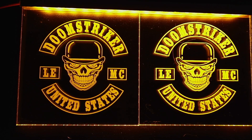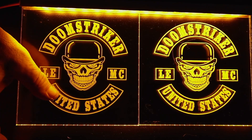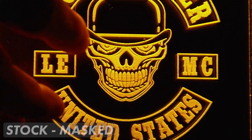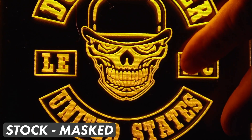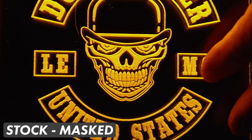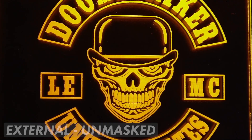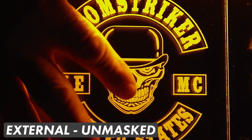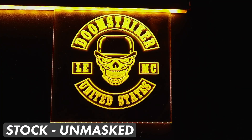Here we have two separate pieces of acrylic with the same logo. This one was done with stock air assist, this one with external air assist and no paper. This one with paper and stock air assist is very deep — the lines are not clear, they're kind of jagged, and it's just rough. With the external air assist you can see it's a lot smoother. There's no depth whatsoever. The lines are super nice, tight, and clean.